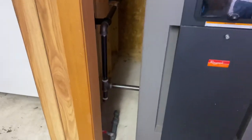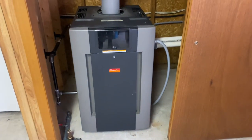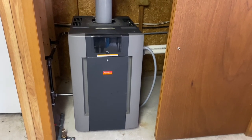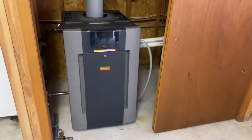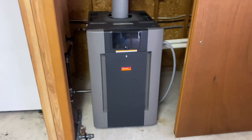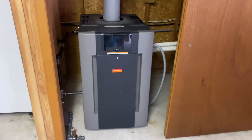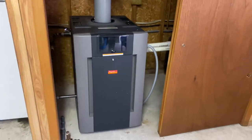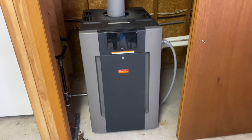Here's the heater end of things — you can see the final plumbing down here. This ties into my appliance videos — the one about why aren't we fixing these things if we can fix small engines and keep old things going. I bought this pool heater in January for $500, obviously off-season, and the guy gave me the famous line: 'well, it ran when it got taken out.' The biggest problem with these units is the heater core — it gets rotted out if the water alkalinity gets too acidic, and to replace one brand new is very expensive, anywhere from $1,000 to $1,500.